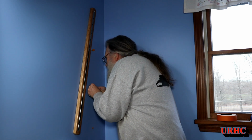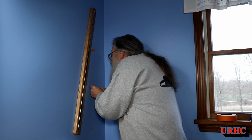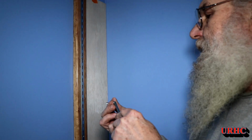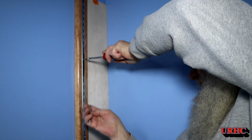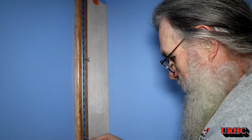That really helps when you're drilling with sheetrock. And with the holes in place, I just got to get the other 3 inserts through the wall there, those hangers. And there again, you can see out the window, it's still snowing this next day here. And then just put the screws in, and that one bracket is up.